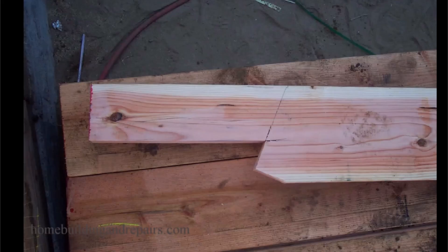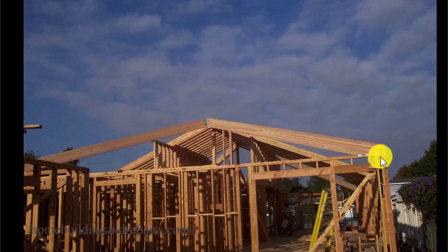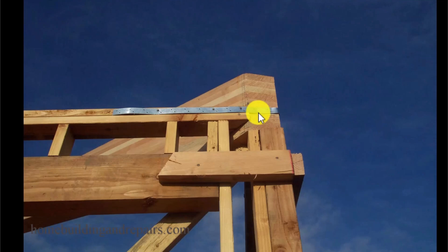The first thing I would suggest is that you contact the structural engineer and have them provide you with a fix. It's not your job to figure out how to cut this stuff, and you do not want to be responsible for making a mistake. Here's what happened on this job — I asked the owner before they poured the concrete and asked a few more times before we finally got to stopping the job, but the owner didn't want to do that. He went ahead and approved the solution I will provide in this video: lowering the hip and not hacking away at the bottom. After it was done, everybody was happy — or at least nobody mentioned it ever again.